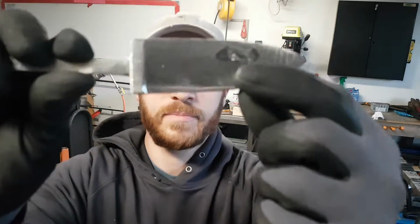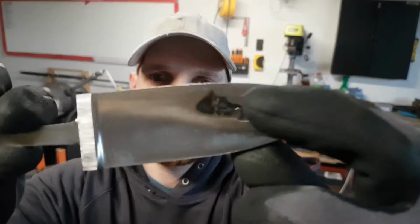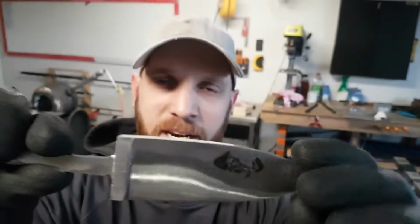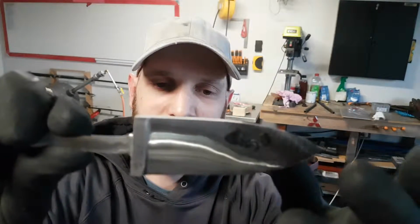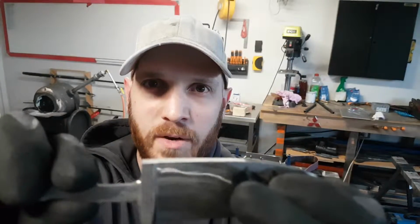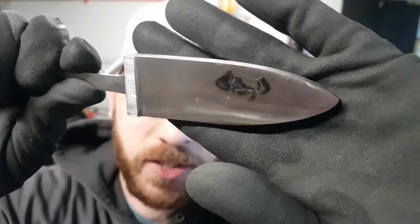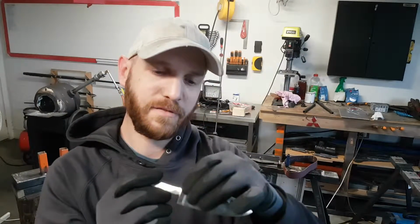My oopsie. This discolored spot here, I don't know how well that's gonna focus up, but it has discolored like that because it's overheating there, and it's overheating there because I'm fairly certain that this is the side that the 1084 was on, and I've ground through a spot of the 1084, and because it's a different composition to the 1075 behind it, it's not really one piece, so the 1084 is heating up independent of the remaining 1075 in here, so the outside layer can get way hot. Now looking at it, I don't know how well that's going to show up, but there's very clear delamination there. It's just garbage. Hopefully, with more grinding, I'll just get rid of the 1084 altogether. Along here anyway, it'll still be here, because it's at full thickness there.